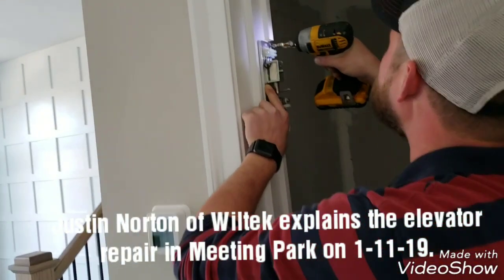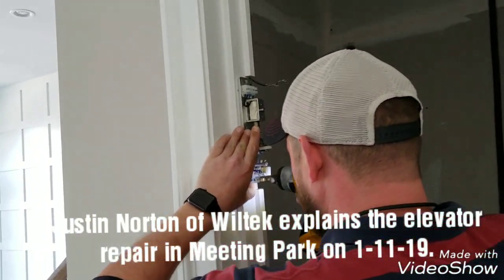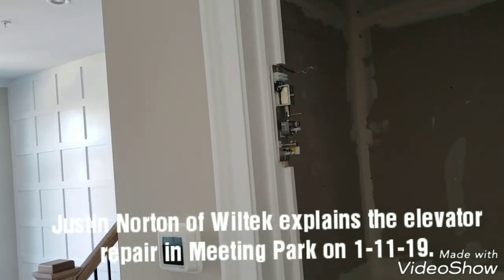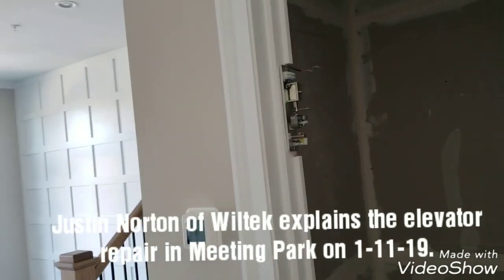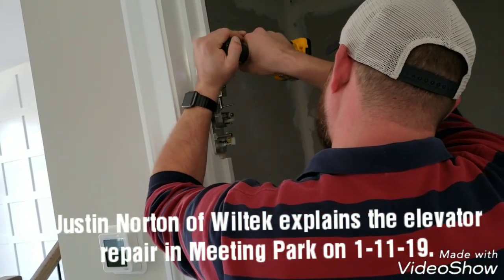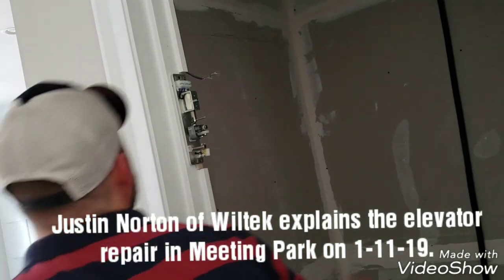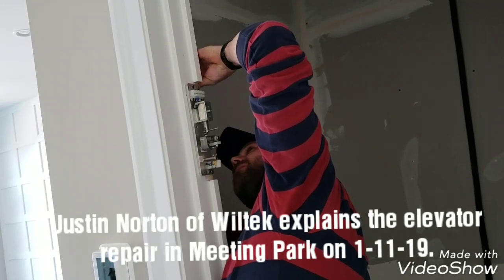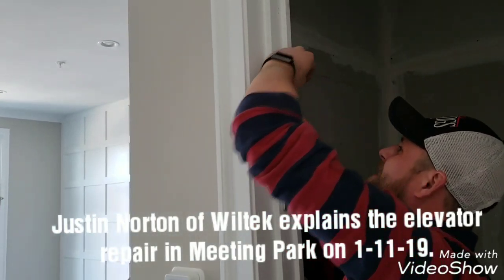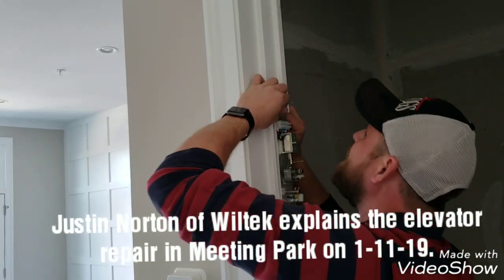So was one of the naked wires making contact with the metal or something? They had it pinched down a little too tight on the wire, so they didn't actually strip it — they just let that wire get pinched. No pinch there now. It goes right through.